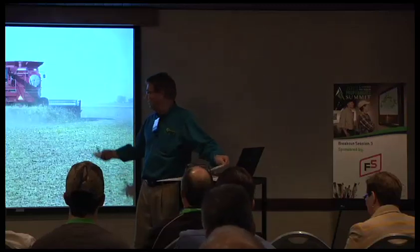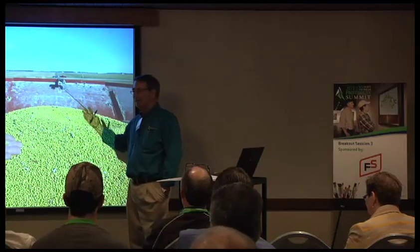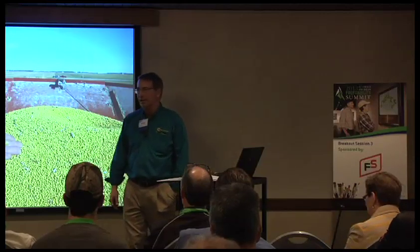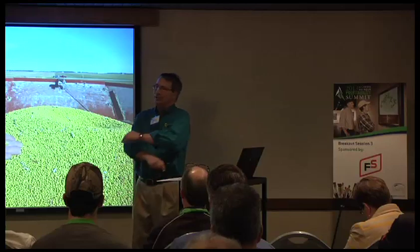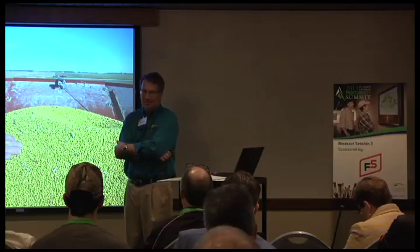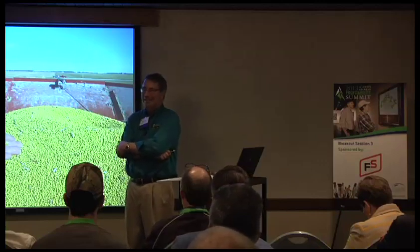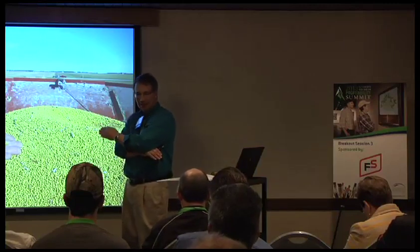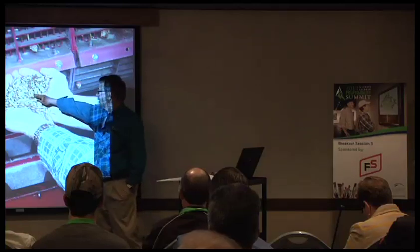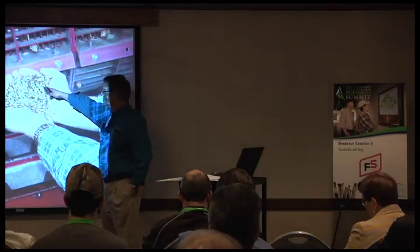Combine and green beans — the biggest problem I see is pods in the grain tank. We're all doing it, and as time goes by we're going to see more and more green stem beans at harvest. My first instinct was always to close the bottom sieve. But pods in the grain tank — is that a separating problem or a threshing problem? It's a threshing problem. I did a kill stop and grabbed a handful of what was below me. Sure enough, there were quite a few pods down in there that were supposed to have been threshed at the concave.